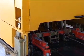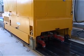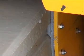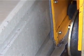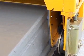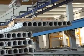Compacting the concrete and allowing the machine to advance on the bed with diverse speeds depending on the height of the element being produced. All the mechanical components driving the tube formers, the side formers and the Archimedean screws are mounted in an oil bath. This permanent state of lubrication cuts production costs by reducing servicing and expensive maintenance. The final product has excellent technical characteristics and a good finish quality in both standard production widths of 1.2 meters and 2.4 meters.